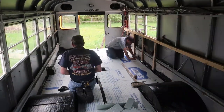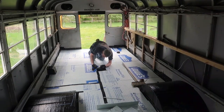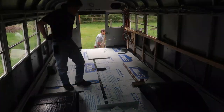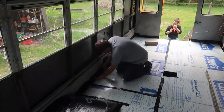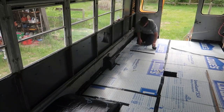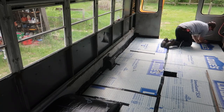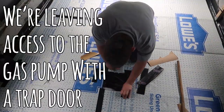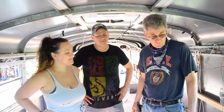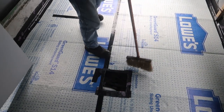And then we used duct tape and duct taped it all down, which created an insulating barrier. And then we added another layer of R-Max half inch, which gave us almost 3/4 inch in insulation barrier. And we also used tape up the sides so that there's no chance for leaks or air infiltration at all through the bottom. Gary's working. Corey's watching.